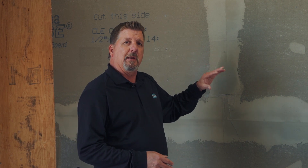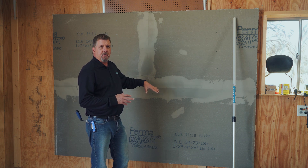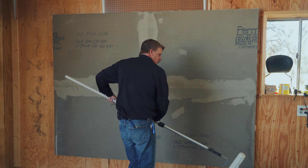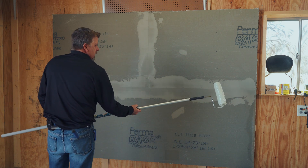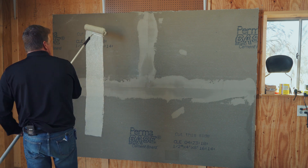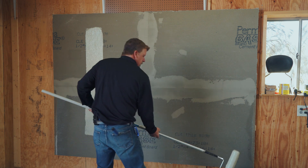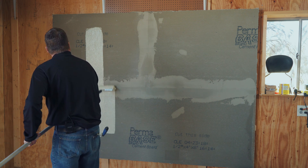It's not really painting — we're trying to get an application. It's a two-coat system at 15 to 22 mils per coat. You put up the first coat and allow it to dry. It starts out with a light sage color and turns to a dark sage. Once that's done, we can do the second application. Load the material on the roller and go up and down, then go the opposite direction.